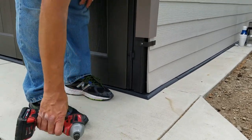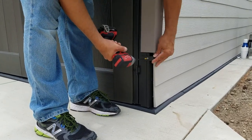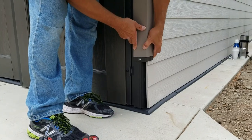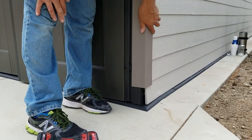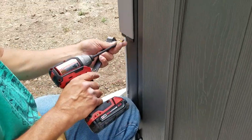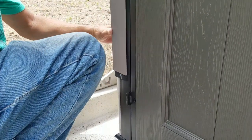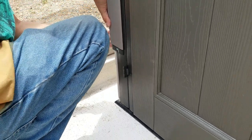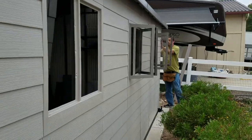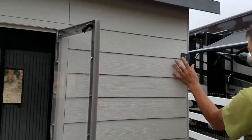The back two corners are going to be very similar to these, but the brackets — the little L-brackets on the corner — are going to be the plastic ones. There should be about ten of those plastic ones and ten metal ones. These here are the metal ones that screw into the little holes in the door jambs on each side of the shed in the front. The plastic cover slides right onto those brackets that were screwed on. I probably had to adjust that bracket a little to pull it away from the metal so the bracket would slide through the side channels of that little corner cover strip. Slide the cover strip all the way down to the bottom and they're on. I think they get one little set screw on one of the sides to hold them on as well.